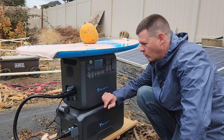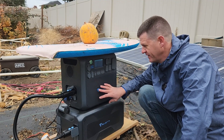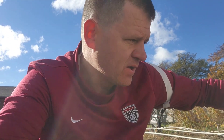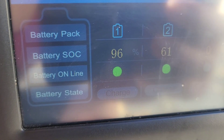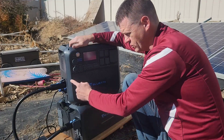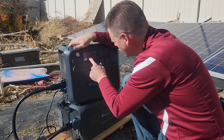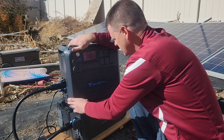With just solar, it looks like it's only charging the primary battery, not the extra battery. The next day it's very sunny at 10 AM. The solar panels are in a 3P2S configuration getting 900W — the max for the AC200 Max. Top battery is at 96%, bottom battery is at 61%. It does look like solar does charge the expandable battery — it first charges the main battery, and now this one's at 99% while the auxiliary jumped from 60% to 80%. We still have 850W coming in — it's working great.